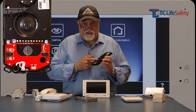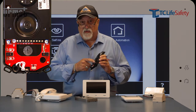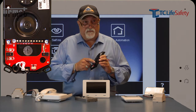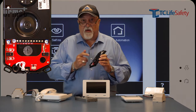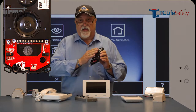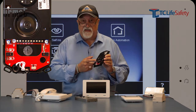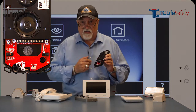There is SE1 and SE2, which is a connection to a 12-volt door buzzer. On apartment buildings you ring the doorbell and somebody buzzes you in — we have that capability with Urmet. That's a 12-volt output; it goes positive 12 volts DC when you push the button at one of the consoles to let somebody into the house.